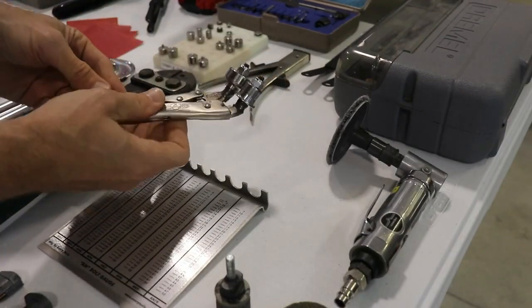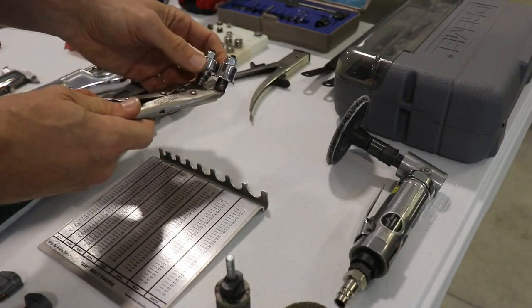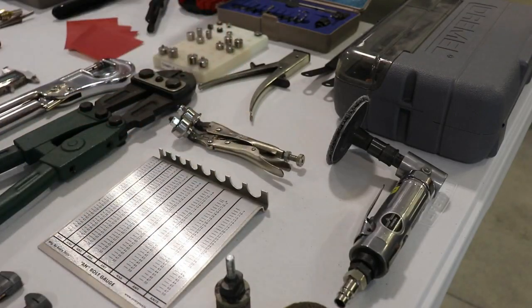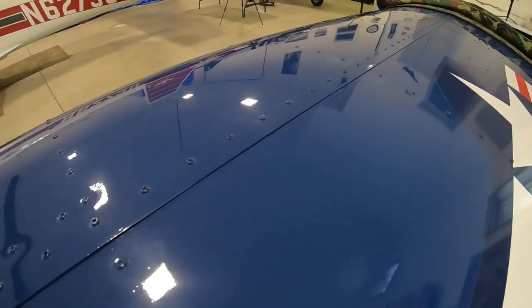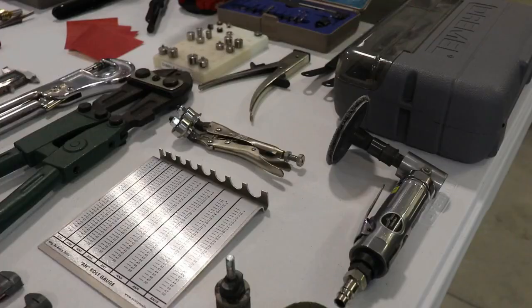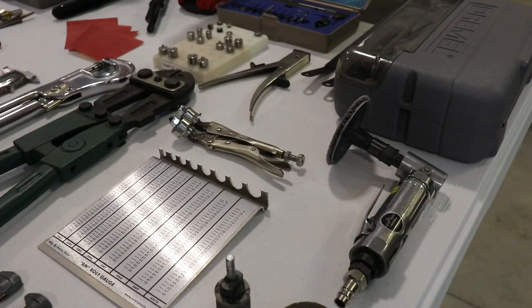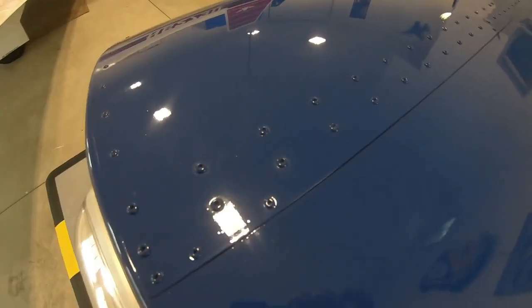Here's another tool that's really handy — it's a pair of vise grips with wheels welded on. What this does is give the edge of aluminum a very slight bend. Really all edges that are riveted together should be bent slightly, and it helps seal the two pieces of aluminum. On the side of my fuselage I used it on the top piece and it makes the edges nice and tight. On my wing I did not use it and I really wish I did, because there's a tiny space between the wing skins I can slip a fingernail in.